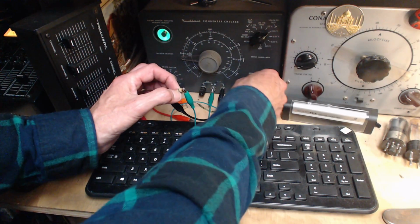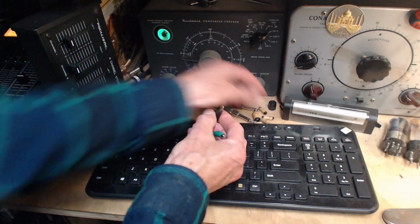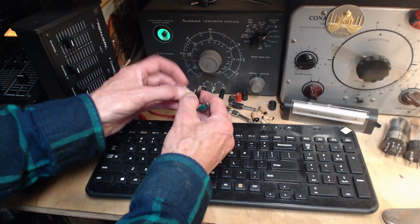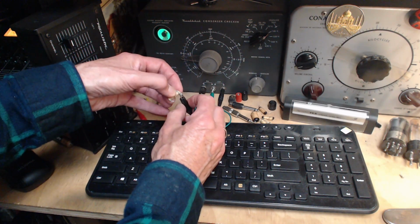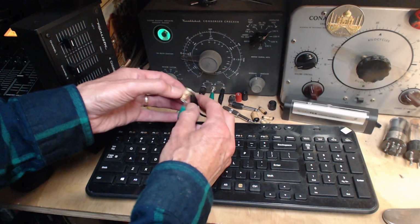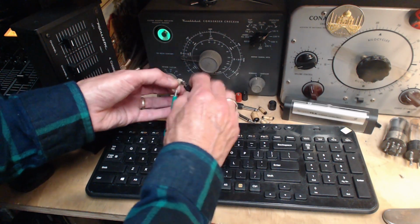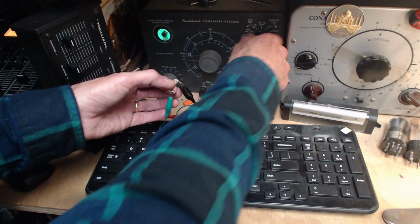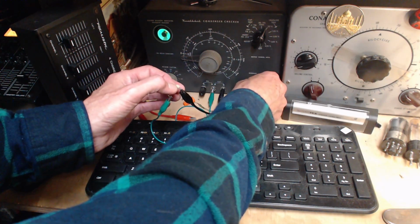Right open at 50. Not open at all. So they're varying. They vary. Now I wonder if that's because of the kind of service they had in the radio, although I'd be suspicious it's the temperature. That some of these are positioned close to a tube or in some place where they get hotter from adjacent components. And that's what degrades them. Right open.